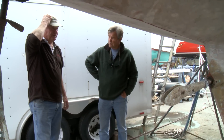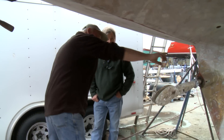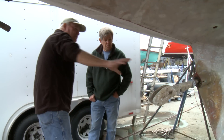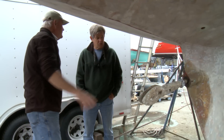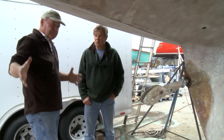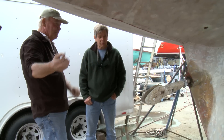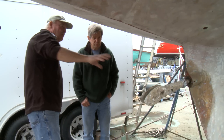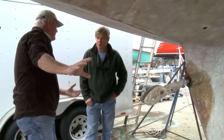So it's got a lot of history behind that boat. Here's our situation: we had a nice meeting with Ethan from Beta Marine, and we're trying to do a lot of things at once. We have an old engine placement situation leading to a V-drive. There are known structural problems with the fiberglass, and we have a bronze shaft log which has a reputation for corroding inside the fiberglass. Our major objection is the V-drive system puts all the engine systems aft and under the cockpit under the quarter berth. We'd like to turn the engine around, so the question is where the shaft log exits and what the maximum shaft angle is down there — Ethan wasn't sure what you'd recommend.